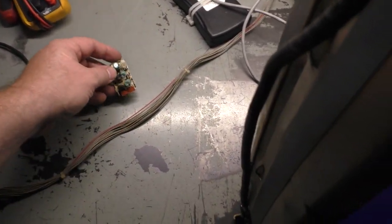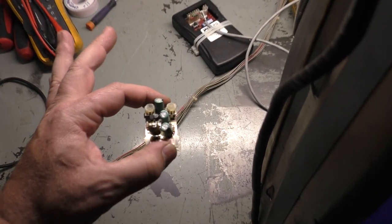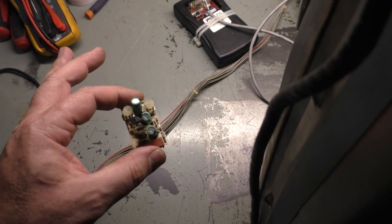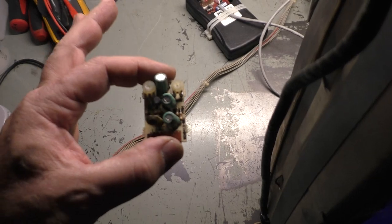We've got all blue, and we've got some severe pin cushioning. Let's just take the pin cushion board completely out. You can disconnect the pin cushion board while the chassis is running, and let's see if that fixes our pin cushion. Yeah, it's a square image now. So this is really only needed on 27 inch. If you have a 25 inch and you're running one of these on a 25 inch tube, you don't need the pincushion board. It's only needed for 27 inch, and it really kind of just causes problems if you're running a 27 inch chassis on a 25 inch tube, because you saw the issues it was having there.